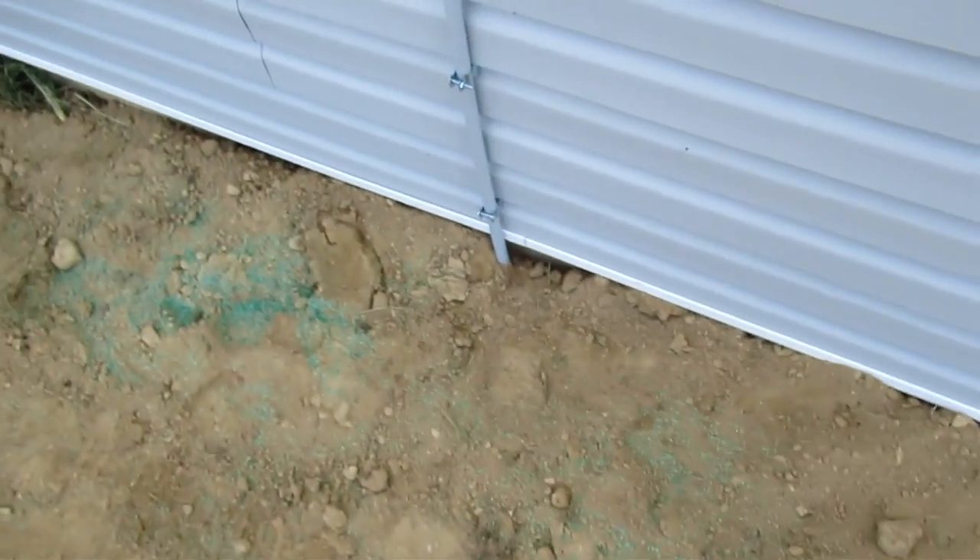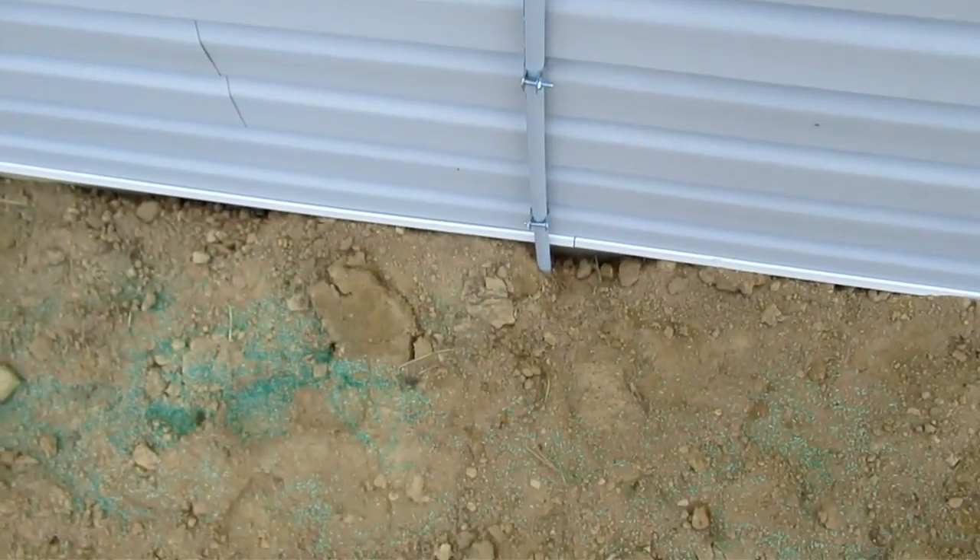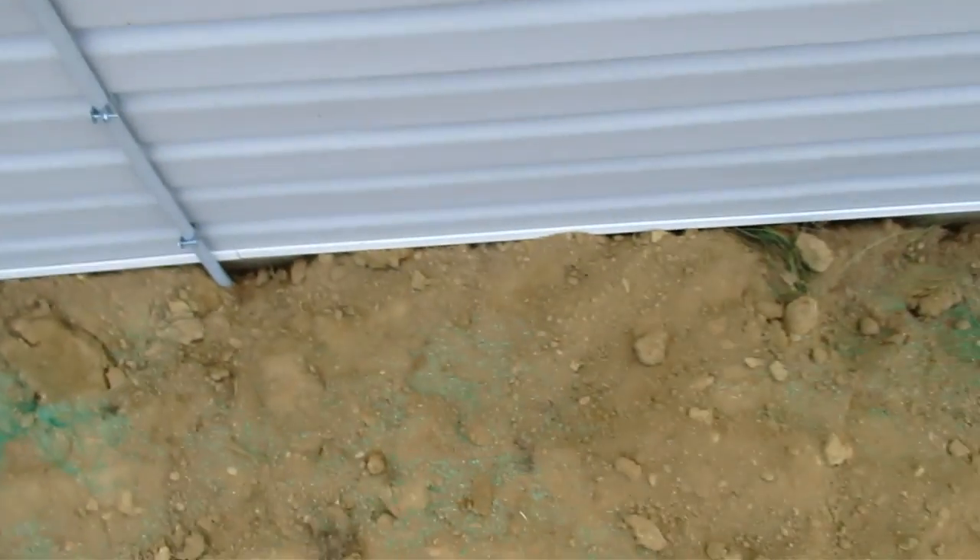It's going to be over in this area here. And you can see the conduit is going all the way down into the dirt. It has to be a minimum of one foot underground. That is the code requirement for this area.